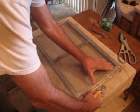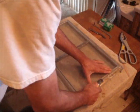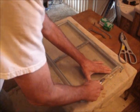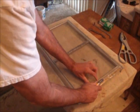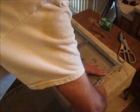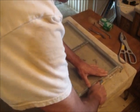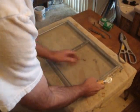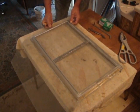A lot of people would just go ahead and roll the screen in right away, but that won't work — it'll run off in different directions. You'll get better at this with practice, so if you mess up the first screen don't worry, the stuff's not that expensive. Get a hold of it about an eighth of an inch over the end of the lip, then push it in — don't roll it, just push it in and get it in there good.